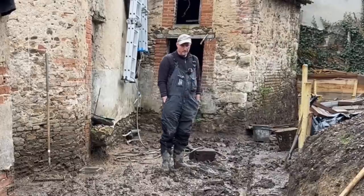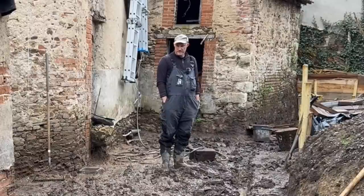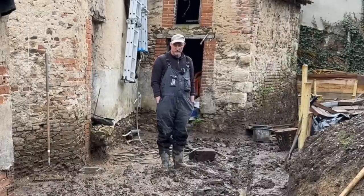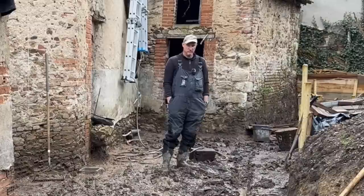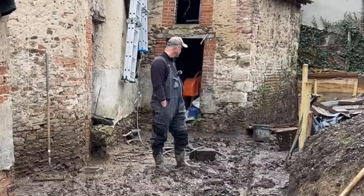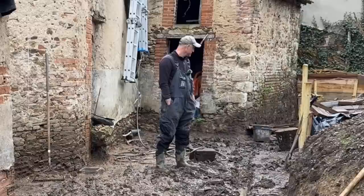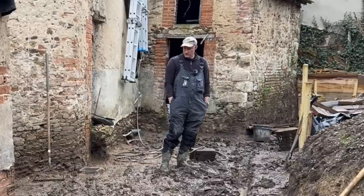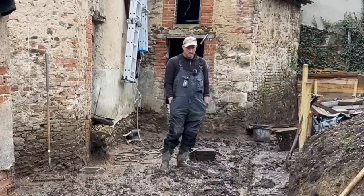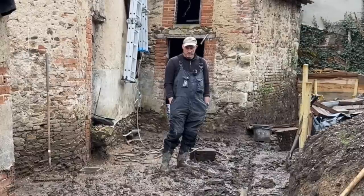See, ideally I do all the work that involves moving sand before I lay down the geocloth and the gravel, because I don't want the sand to mix with the gravel, obviously. But I'm starting to think that maybe I should just level it with the rake as much as I can, dig the channel, put down that geocloth, install the drain, French drain, and order the gravel, and then put the gravel on top.